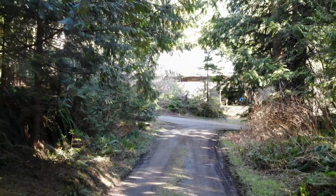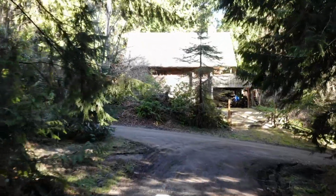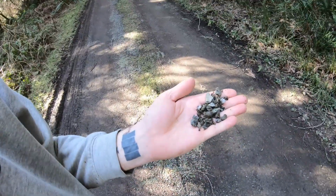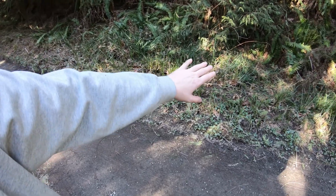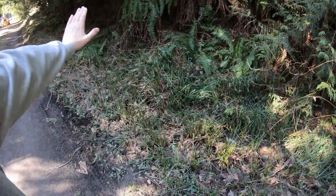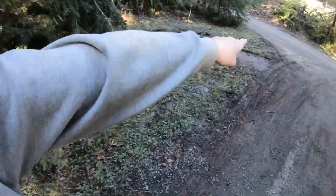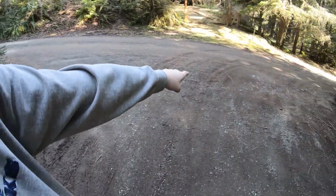I mean, there's not a lot of material on the ground, and when we first moved in, we dumped like 2 or 3 inches of this stuff, this 5/8 minus. We got this whole issue here, like a big puddle forms here. You can tell by all the reeds. I'm going to try to smooth this back and contour this a little better and make this an honest ditch that can drain out basically to the center here. And then I'll make sure this is formed a little better to make sure that water can drain down.